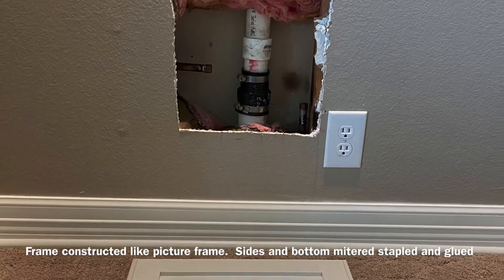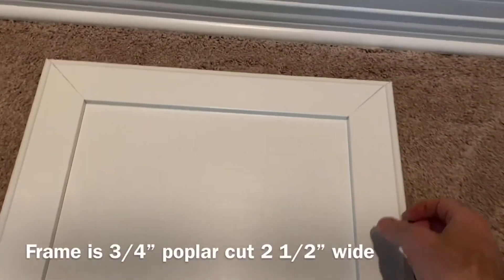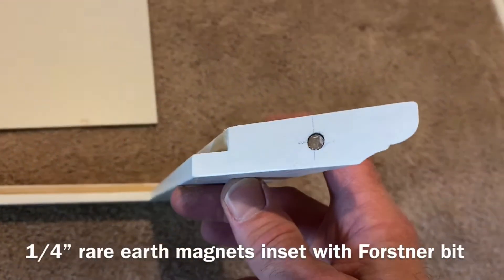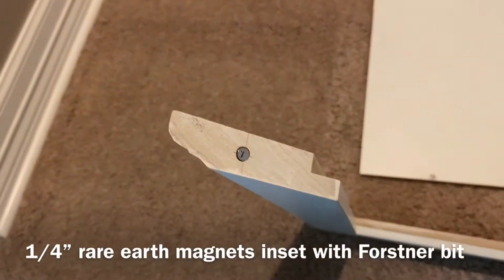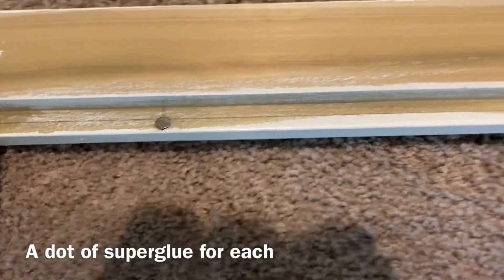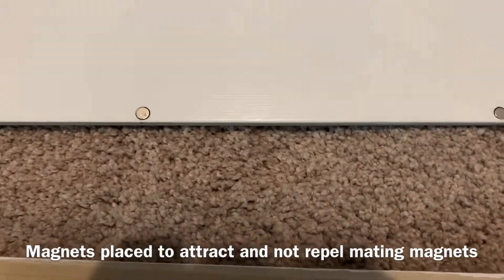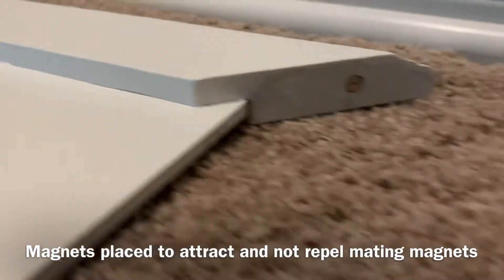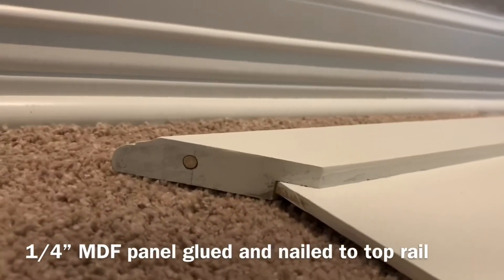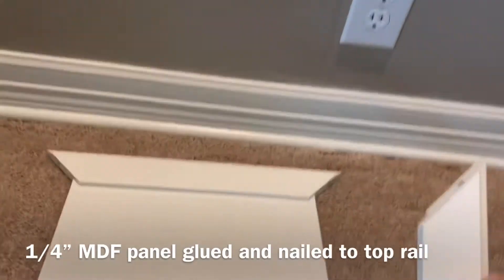The panel is made just as any picture frame with three-quarter inch poplar and the edges are rabbited on the inside to receive the quarter-inch panel. I used an MDF quarter-inch panel and I simply put rare magnets, quarter-inch diameter rare magnets, into the locations where the surfaces would oppose one another, making sure that I used the correct polarity to make sure they didn't repel but rather attracted each other.